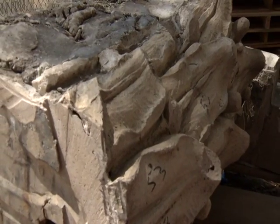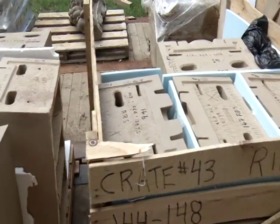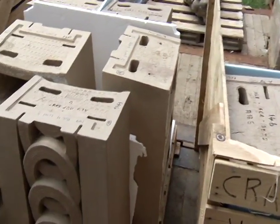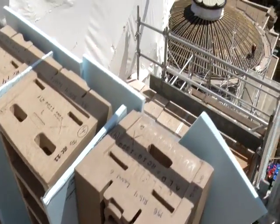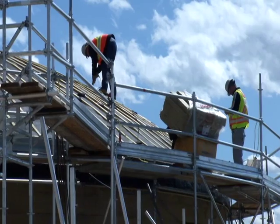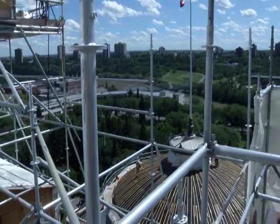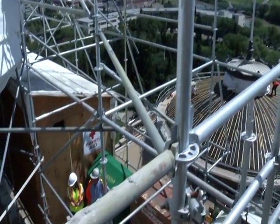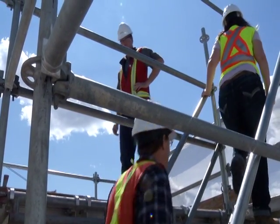We took examples of every original piece and had new pieces made in New York. For stone pieces on the two domes — because there's a major and minor — we're at about 18,000 pieces of stone to replace. Plus, we're adding a waterproofing layer, a drainage layer, and spray foam, which is going to help with preserving this product and making it last even longer. At least 100 years — we're going for more.